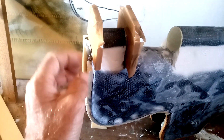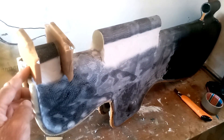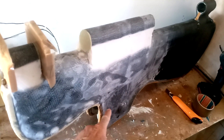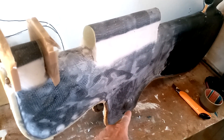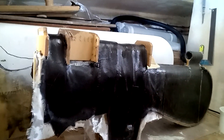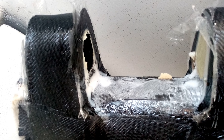I'm making this bottom hinge very strong, and I will later do exactly the same to the one on top, but that's not yet in the right position. We also made this bump for the ropes that hold the rudder plate in place that will hinge at the top. All the carbon fiber UDs are now over the pipes from this new rudder house — we have a strong hinge now. When we take the foam away, you can see it needs some cleaning up, but they're strong hinges.